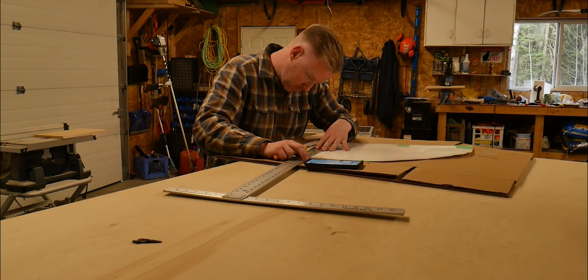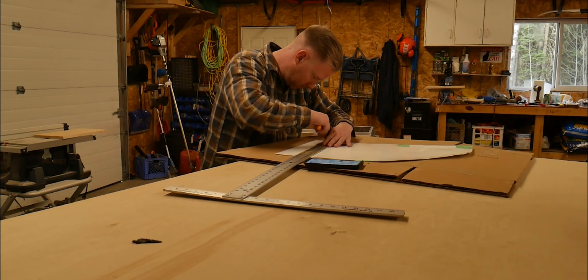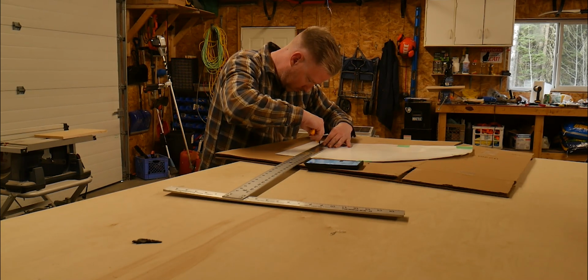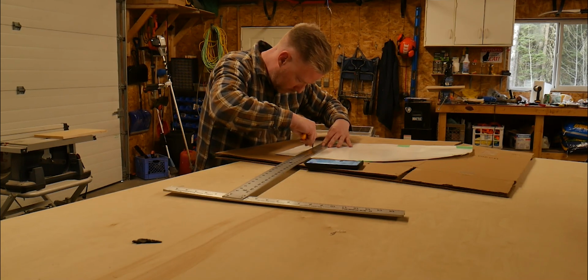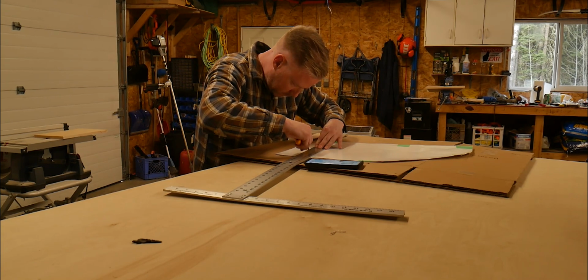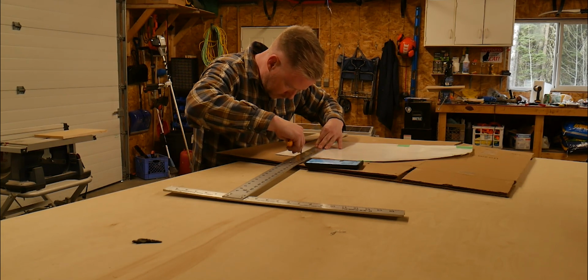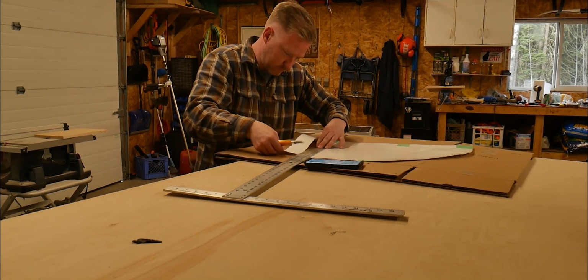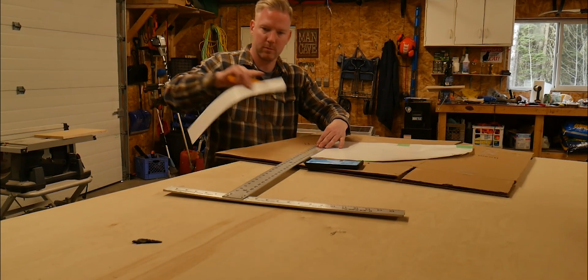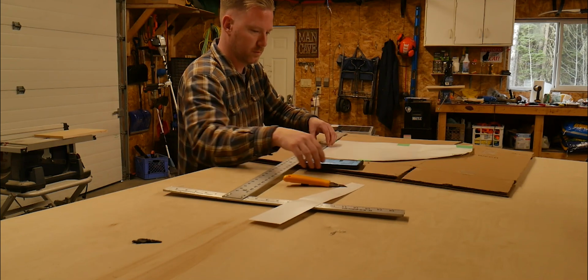My initial idea for this cabinet was to have a rounded edge on one corner as you come down the companionway, so not to bump into it, but as you'll see in upcoming shots, I failed miserably at trying to bend the wood. I tried everything, soaking it in hot water, using a heat gun. The top layer of the plywood, I think it's called the veneer, kept cracking on me.